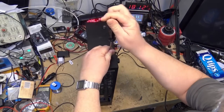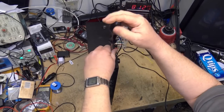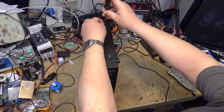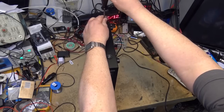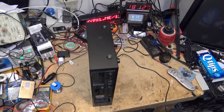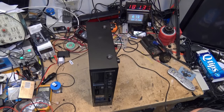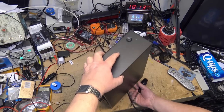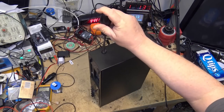Got a light that keeps going on and off behind me. You see it, all of a sudden the light level changes. It's because my floodlight behind me is going on and off. It's a 40 watt or 42 watt CFL bulb, but it also has been in service since 2002. I've got two original bulbs. One is the one I've shown before where it's held together by a zip tie. I think this one here is probably suffering the same fate. If I tap it, there it goes out, you see? It comes back on. I have a feeling I'm going to have to take this one apart and resolder a connection on the ballast. But it's an old bulb that just keeps going.